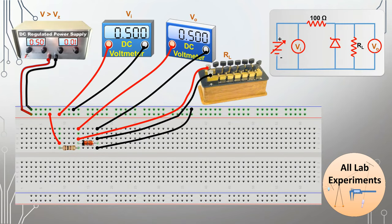Now in the second part of this experiment we come to our circuit again, but this time we will set our input voltage higher than the zener voltage we observed in the last step. Let us consider that in the last step we observed a zener voltage of 4.7 volts. So now we can set our DC power supply to a value like 5 volts or 6 volts, something above the zener voltage.